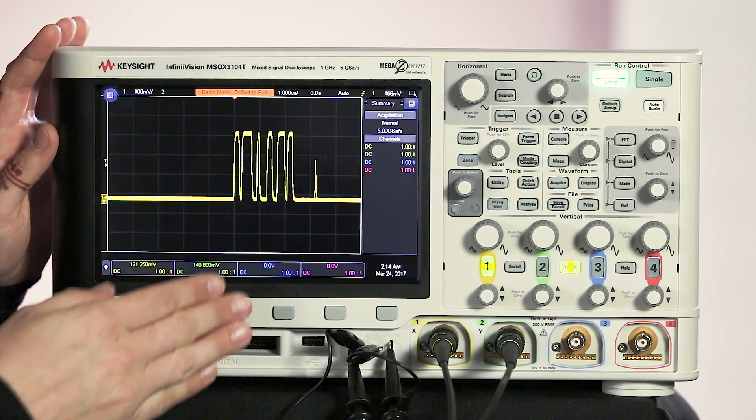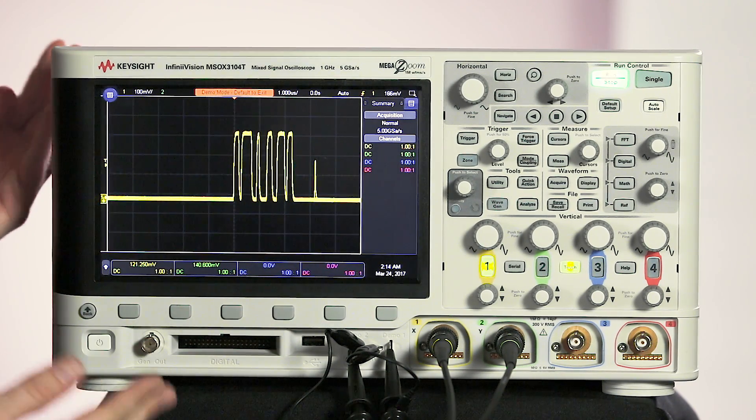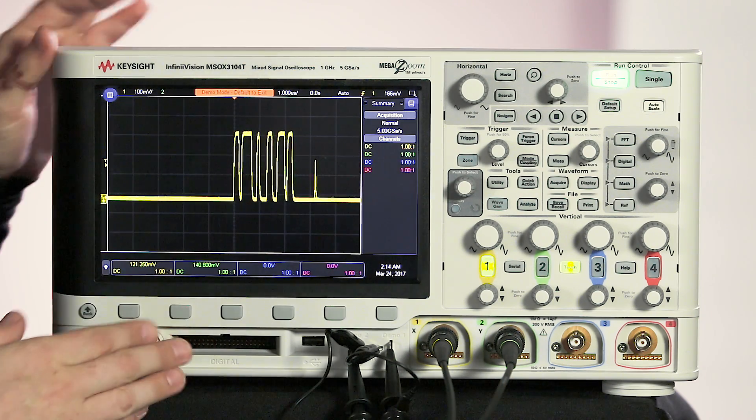It's really easy to make pulse width measurements when you have an exactly repeating pulse every time, but what do you do when the pulse widths and the pulse characteristics are different every time? That's where gated measurements come into play. On the screen we have a digital burst and we can see there are seven different pulses in there that all have different pulse widths. So how do we actually measure each of those different pulse widths? That's when we use gated measurements.